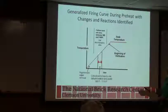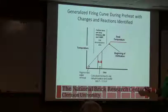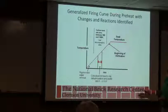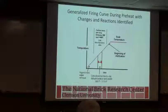So you've got your carbon burnout in the first part of that preheat, followed by your dehydroxylation and your quartz inversion, which happen fairly close together. And any residual water in the body, yes sir?